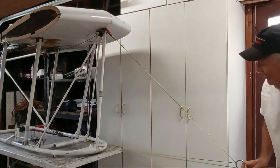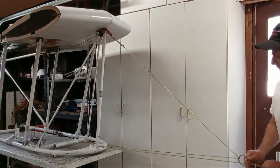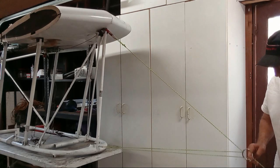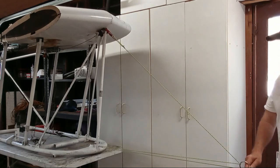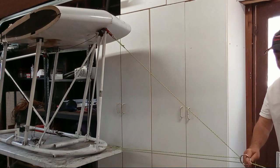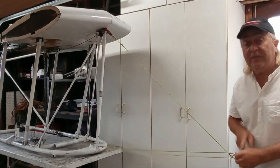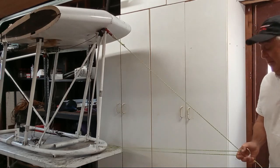But what we see in the video is when I lift the nose off the ground, this pretty much stays right here — it doesn't come up or go down. But the forward portion of the rope goes down at an angle. So this rope is pulling me down. As I lifted the nose, this would come up like this, and then we'd have a downward force going up to the hitch on the truck. So as soon as I would get the front wheel off the ground, it would come right back down again. So maybe this isn't working quite as expected.